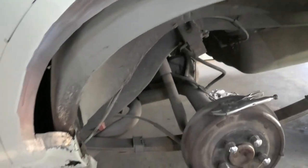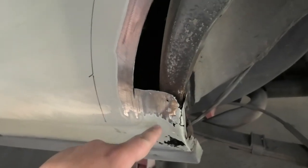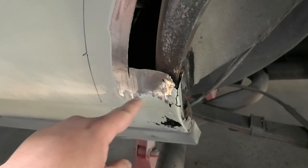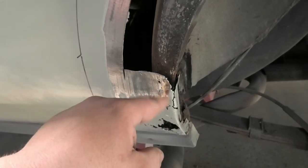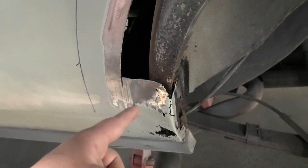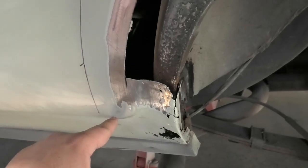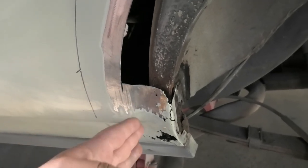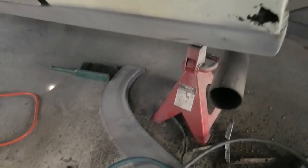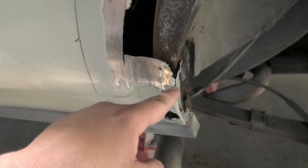So, getting straight into it without too much chit-chat, better back, give the dog a bone. We are going to cut probably right through here, I reckon. I'm just going to go below that brazing weld right there, but keep the transition. See, that style line changes and goes up, so I don't want to go any lower than where it starts straightening up. So I want the curve to stay there so I can join straight into it with that, ideally. So probably up, they may even be able to only go about that low.